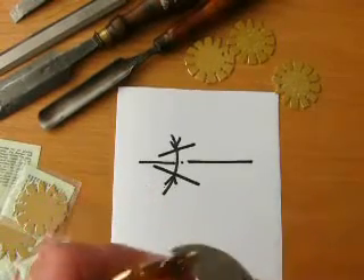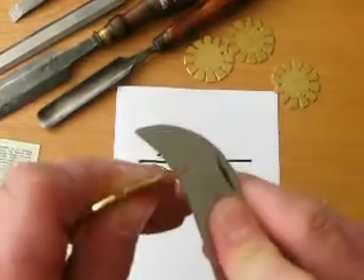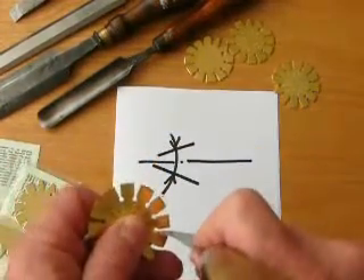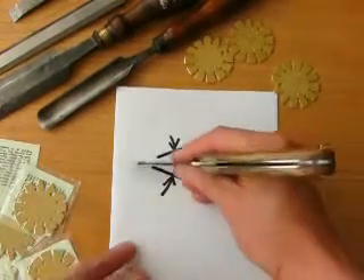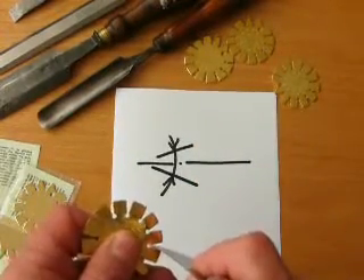We're along the centre line, we're picking up. Obviously got to get perpendicular — perpendicular to the blade, that's it at right angles. Not like that, not like that. Get at right angles to the blade, pick up on that honed edge, and check that it's consistent on both sides, that the blade lies along the centre line — and bingo, you've got your included angle.